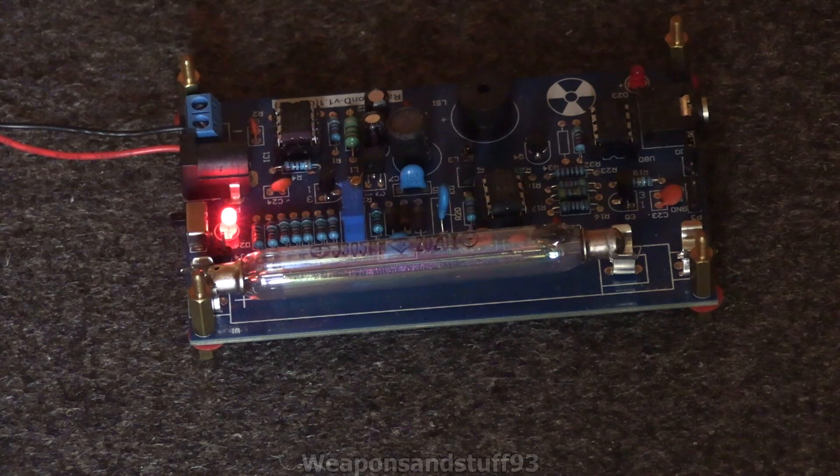One of the things I really like about these glass tubes is that you can actually see ionisation occurring in the tube. You can't do that with Soviet and Russian SBM tubes, because most of those are metal-encased — which is actually better if you don't want false readings. The problem with open-air glass tubes is you'd probably need black duct tape around them for a true reading, because certain types of UV light will penetrate and give false counts. I found that putting a UV torch on some of these gives a really high reading.